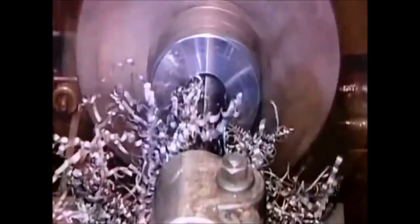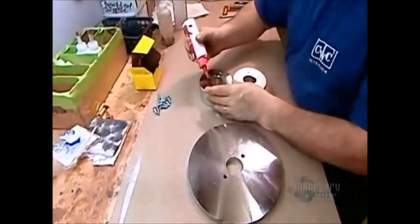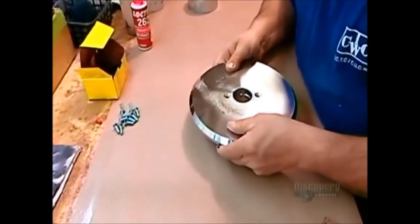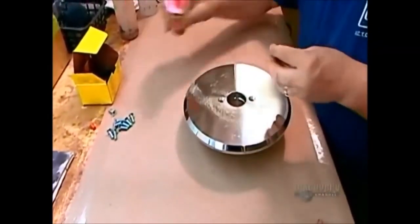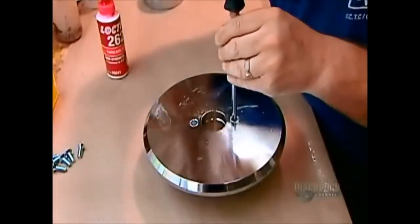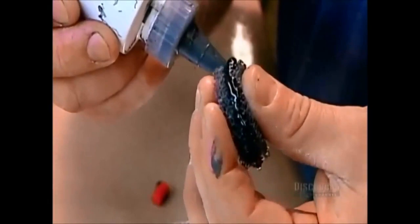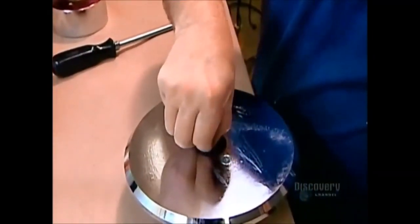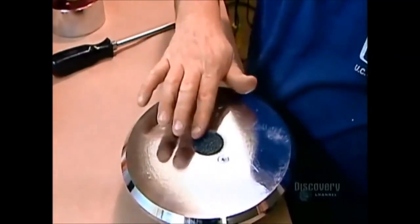A reamer bores a large hole through it. They apply super high strength epoxy glue to the core and to the back plate — the plate with the smaller hole. They glue and screw the pieces together because the bond has to be strong enough to withstand intense magnetic pull. They glue a foam filter in the hole to ensure the vibrating cone doesn't draw in dust and cause internal damage.